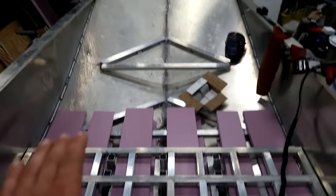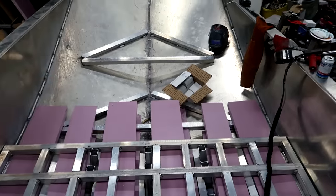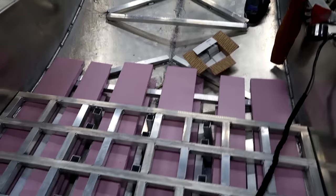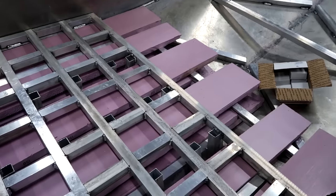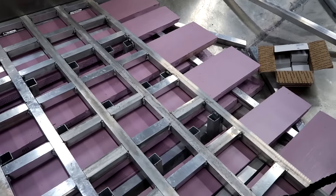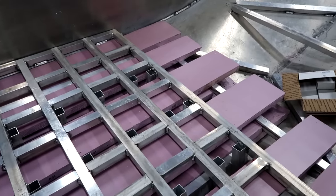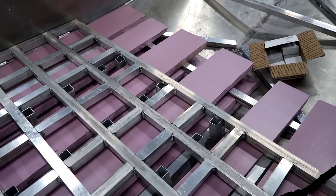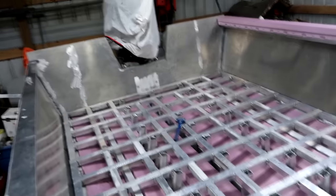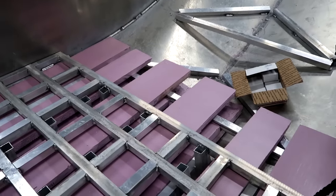By doing a six inch step, that means you're going to have an 18 inch step going from the floor to the front deck, which is too much. So what I'm going to do is come in and basically lose that first run — that's eight to ten inches worth of deck space — and what I'm going to do is, the whole length across from my catwalks out, I'm going to build in a step that is going to house my three batteries for my trolling motor. That'll put about 250 pounds or so of weight forward, which is good because that motor right there weighs 700 pounds and I need some ballast in the front of this boat or else I'll have a lot of porpoising issues.